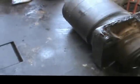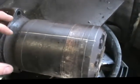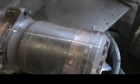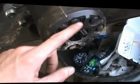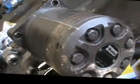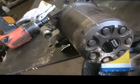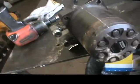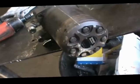So I'm going to scribe a line here real quick. I just used an angle grinder with a zizz wheel and cut a line across all the sections to keep everything orientated — you don't want pieces going back together 90 degrees out. The fittings can stay on. I also ran a screwdriver around the back to get the mud and crap out. These are 9/16 bolts torqued down to about 55 to 65 foot-pounds, so you'll need an impact or stand on it to get them off.